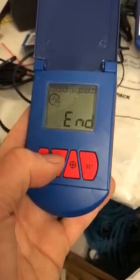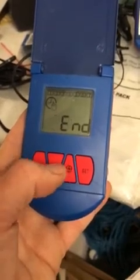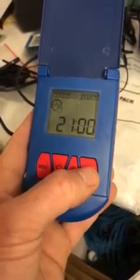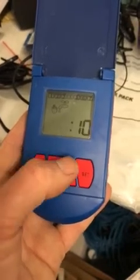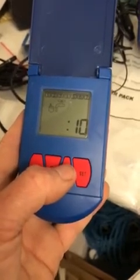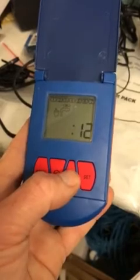Again, plus or minus to adjust the minutes that are flashing, then press the set button. Adjust the hours and press set again. Now it says on time — this is very important. Here it's flashing on for 10 seconds; it's going to flush the urinal for 10 seconds.